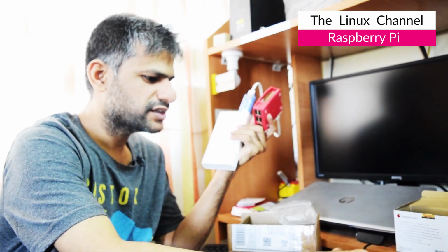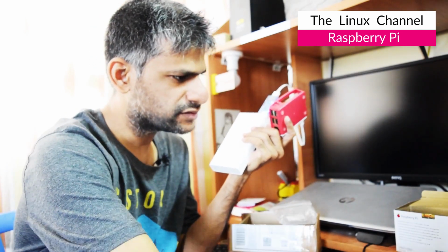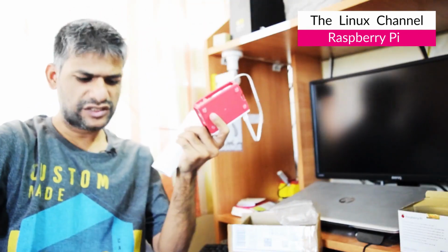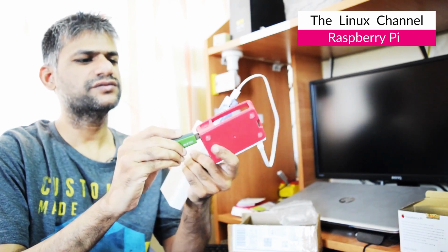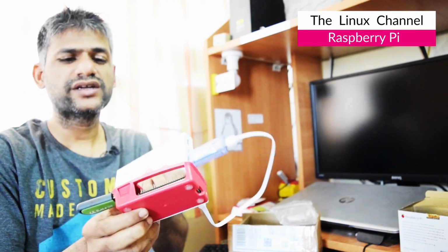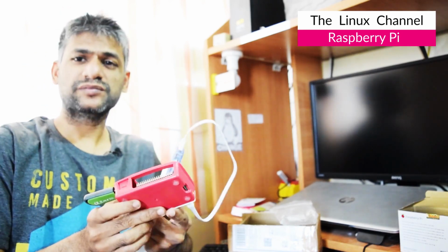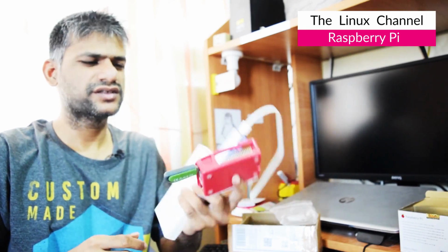So the moment I connect anything else, I can even connect any micro SD card readers, and we can see its characteristics. I can take a bunch of USB drives, say for instance a USB drive, and if I plug it in, we should be able to see its status. It looks like the Pi is not enabling any of these ports because it has not yet booted, so it is not changing, it is still showing 0.32 amps. That is why these readings will change as you connect peripherals. So as you populate all these peripherals, be very careful about the power source itself.